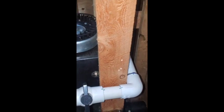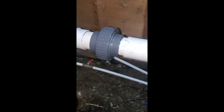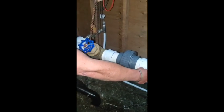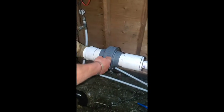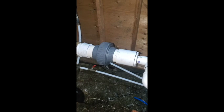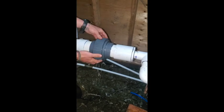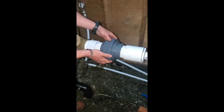The only PVC in the whole system is down here. Both nozzles are getting chunks in them, so we know it's not just a problem in what we built. The problem has to be between here and here, because this goes to my main water supply that's been running for a couple of months now. We're opening this union to reach in and see if there are any chunks here. I don't know if they were already in there getting cleared out, or if the microhydro is actually creating them, but something weird is going on.